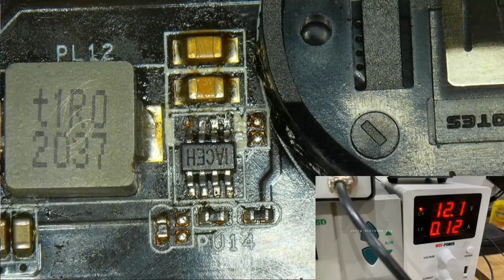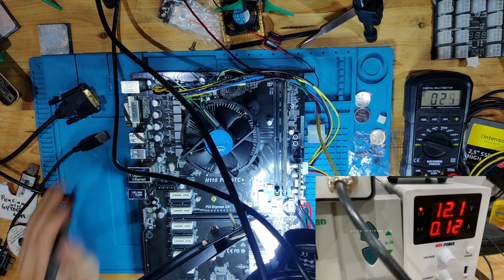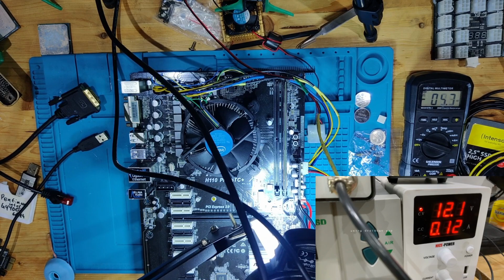Let's go to, and now you can see my multimeter. And now we have 3.3 volts, as you can see. And I gotta say, I probably did that before already. Pretty sure I've killed one of those chips before like that also. Because there's a reason why I had 5 chips originally, and with fixing a single board, I only had 2 left. So I think this happened to me before, and I can very well see that happening to me.